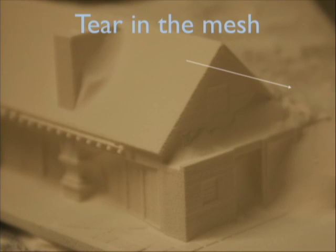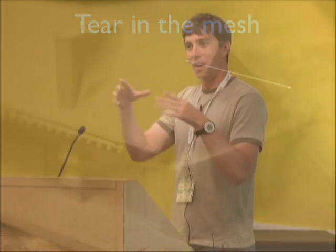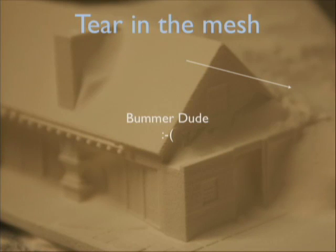What happens if you don't pay attention to the mesh? The software will tell you not to ignore it, but you can push your luck like we did. On the right-hand side, that whole wall out of SketchUp wasn't built completely solid and fused together. If you don't clean up the mesh, it'll basically spill through — the machine can't see what that pancake layer looks like, so it goes to trace that ring out in the powder and puts nothing down, and it just falls through. You have to start over and fix the file.